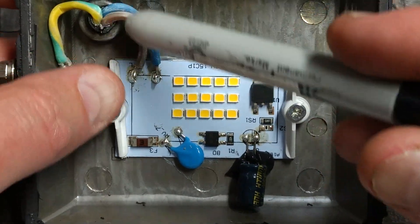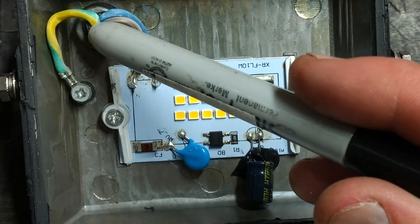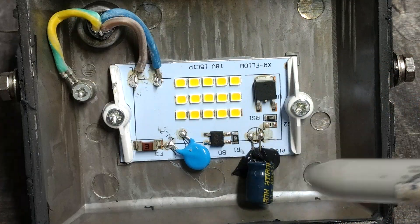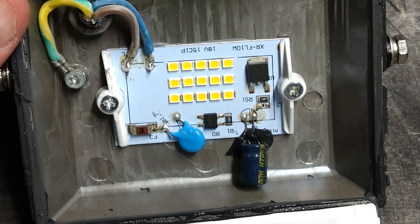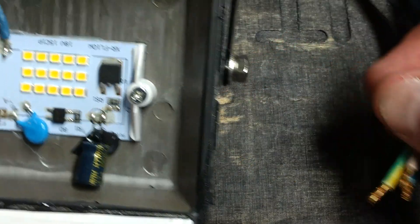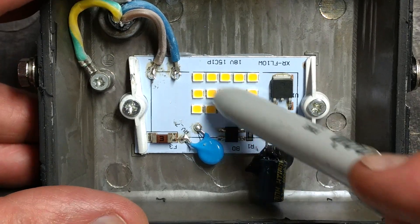Noting incidentally that if water can penetrate down the inside of the cable — and there's no sealing around the top of that — water could get in. When that happens, if this is completely sealed, you're going to see condensation inside the glass, which is a bit disappointing. But it's just a cheap generic product. You just have to make sure wherever the cable is terminated is in a waterproof enclosure, or one that's drained to avoid the end ever getting submerged in water, as can sometimes happen with junction boxes.